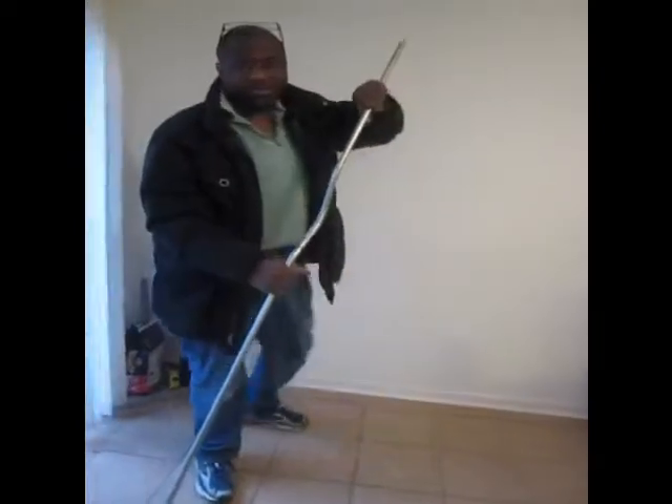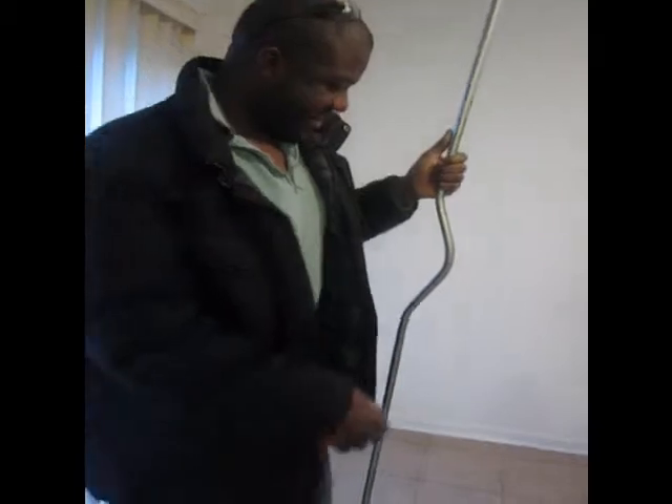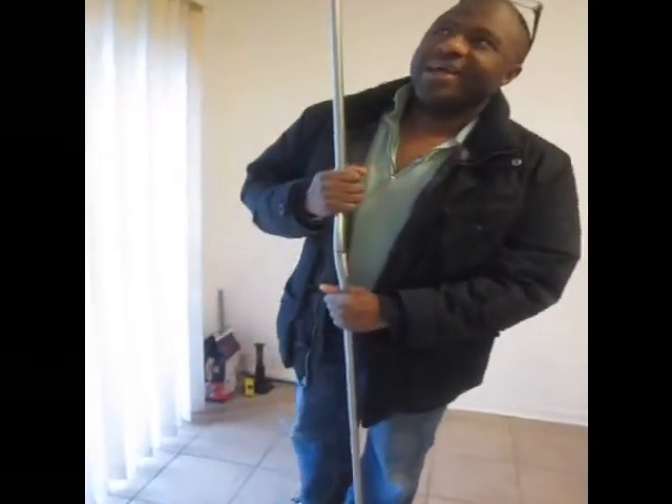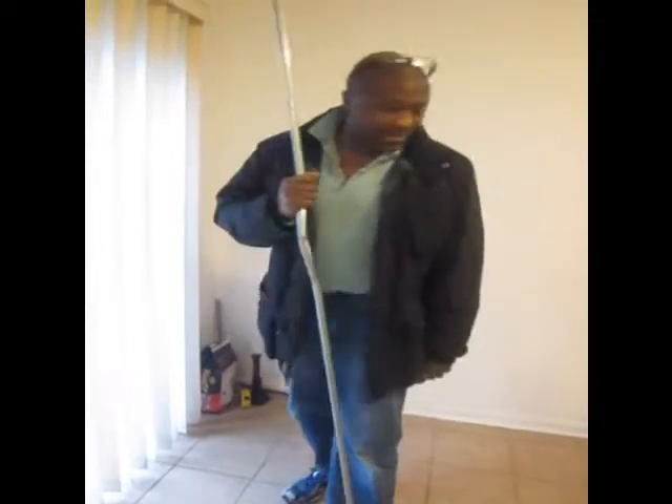So here is my two inch offset. It is a really nice tool to use, as long as you don't over bend like I just did. Make sure it is 22 degrees and 45 degrees — if it is a little bit off, then you will over bend. But then you don't have to throw away so much pipe. This is good for if you have a ground man and he wants to bend some pipe and make a perfect bend to give to the guy up there. That is it, that is a really cool ruler — you have to get it. You will be able to download how to get it, or at least go to a link here on YouTube.